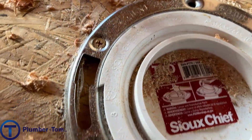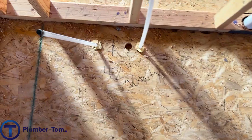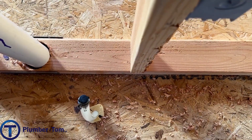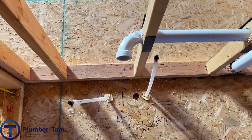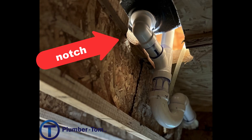The plumber did a good job securing the flange — four brass screws on that toilet flange securing it to the subfloor. The PEX for the lav and toilet comes up through the floor far enough away from the studs so sheetrock, trim, and cabinets can go behind it, yet far enough into the cabinet that it's not in an awkward space. One thing I noticed was the plumber had to notch a joist a little bit to get the drain connection. Technically, we're not supposed to touch the top or bottom of TJIs as that weakens the structure, but if a framer puts that joist right under a tub drain, that's not the plumber's fault — the framer will need to make a structural repair.